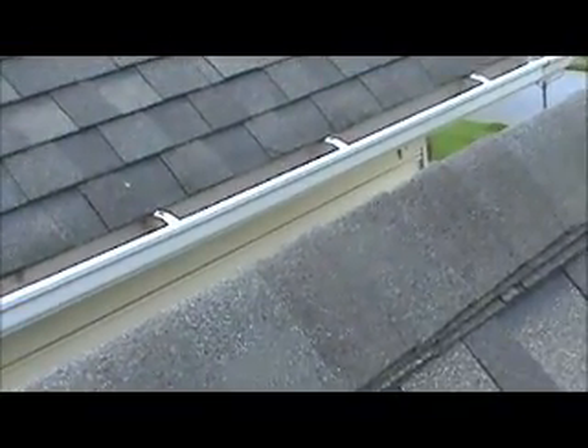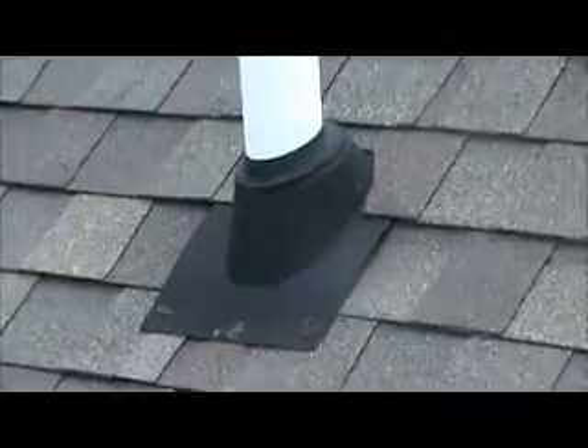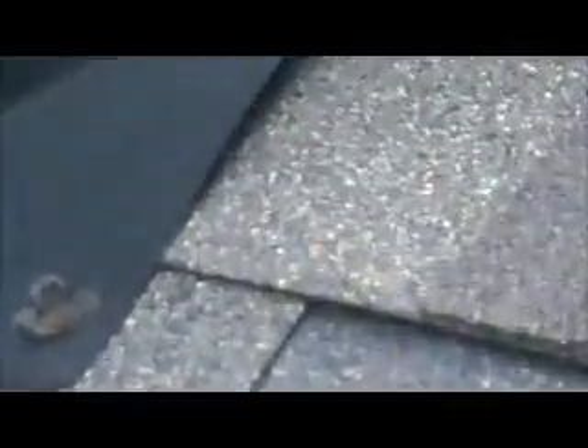It's an architectural landmark weatherwood. Also, on the left hip facing the front of the house, there's one pipe collar here that's installed incorrectly. All of this belongs under the shingles, which means water can run right down underneath this gap and go right into the attic.